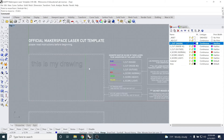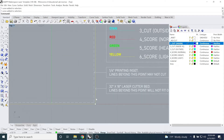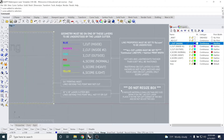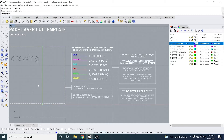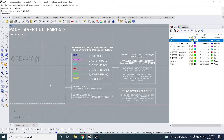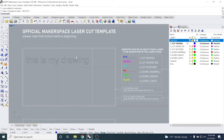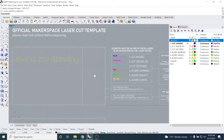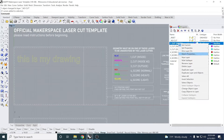Select your outline and put it on the no cut layer. You should do this with any lines you want to skip. It's important to note that the print width for this layer is set to no print. Then take your drawing and put it on the first cut layer, because you want to cut it. Depending on what you want to do with your lines, you can use these preset layers to cut, score, or lightly etch your material. Make sure to read these instructions before doing anything else.